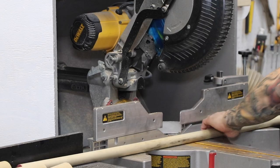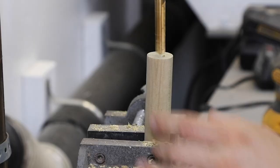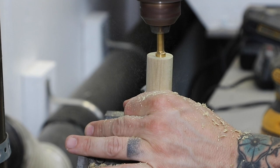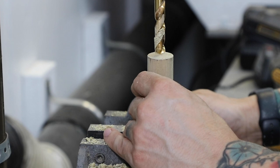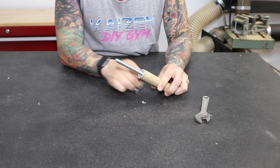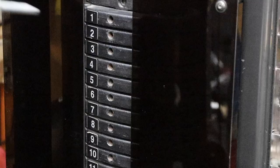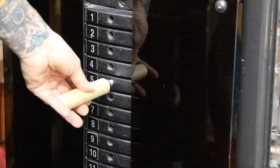Option one is the quickest and least expensive. I use a one-inch dowel for this and cut it to four and a half inches. I take a drill bit and directly drill through the center of the dowel — I didn't calculate where the center is, I just sorta eyeballed it. Insert the carriage bolt, put the washers on, and tighten the nut. This is great for people like me who have random one-inch plates sitting around. Now I can finally put them to use.